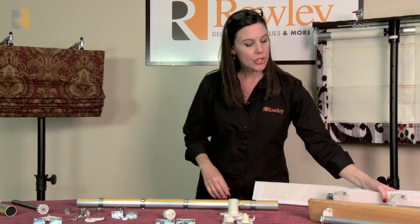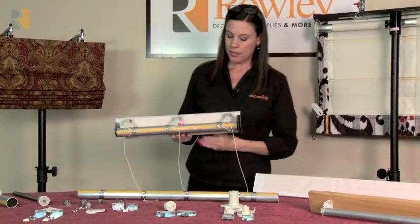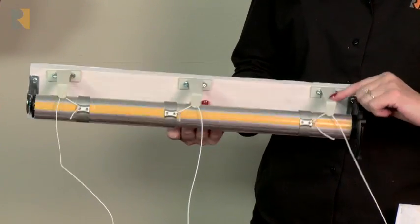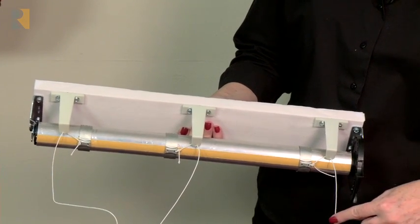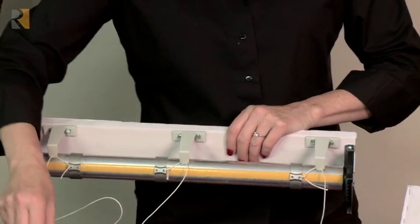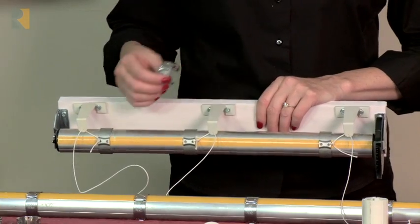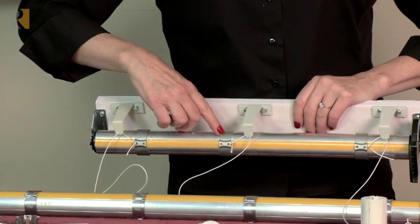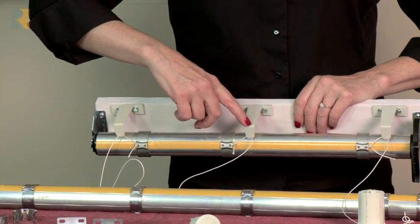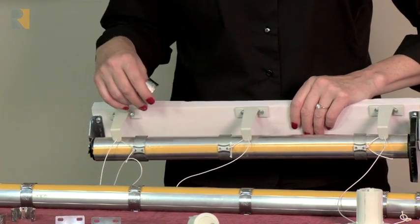You can also use the roller clutch for shades that have encased cord. This example has roller clips and shade stops on it. The cord will come out of your shroud tape, through the shade stop, and into a roller clip. The clip has two holes so that you can tie off on the left or the right. Notice that the clips are offset from the shade stops — the shade stops are directly over your shroud tape, and you offset the clips so that the cord winds in a spiral and not on itself.